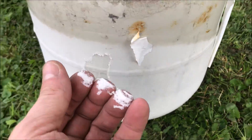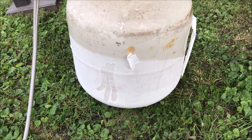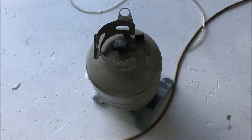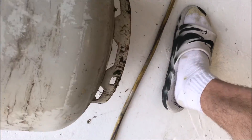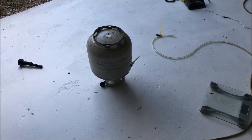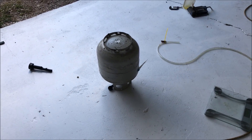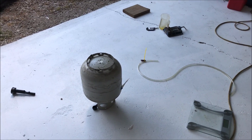But it just gets so cold that the tank pressure drops off below the feed rate we need. I know this sounds dumb, but I am going to try and run one of these burners with the tank upside down. A typical propane burner could never do that — it would shoot 10-foot flames out the front.